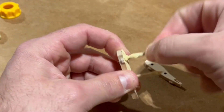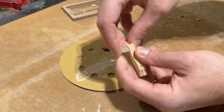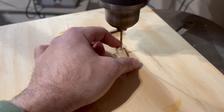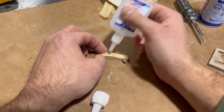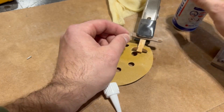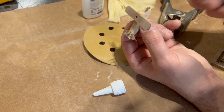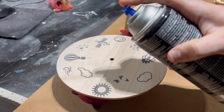After that glue-up and letting it sit overnight, I think it ended up coming out pretty decent. The airplane is a little bit trickier since the parts are so small, and I actually ended up breaking a few of them and needed to make some repairs using CA glue. The airplane body gets aligned and glued together using eighth-inch dowels, which will then get flush cut once everything is dry. The tail wing of the plane gets glued into place by sliding it through the pocketed-out hole in the rear of the plane, and then I did need to drill a few holes — an eighth-inch hole on the top of the plane and a sixteenth-inch hole right in the front to help align the propeller.